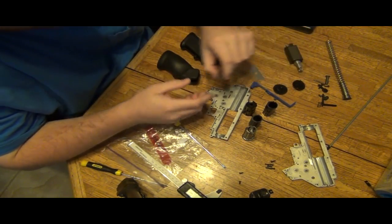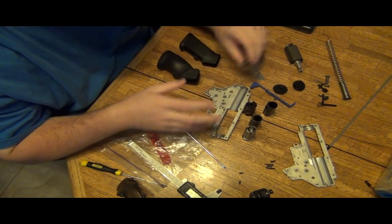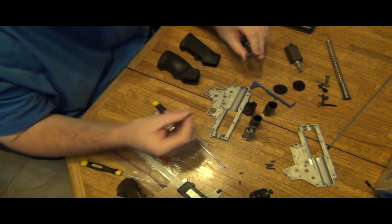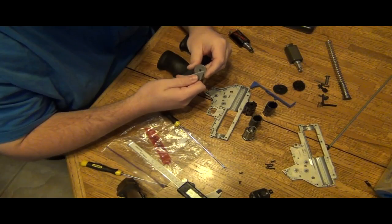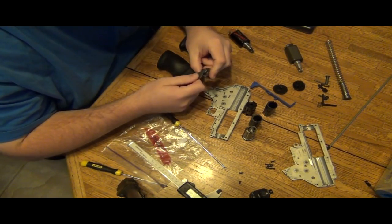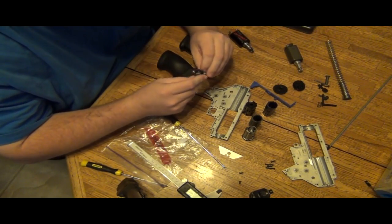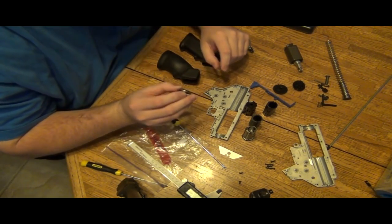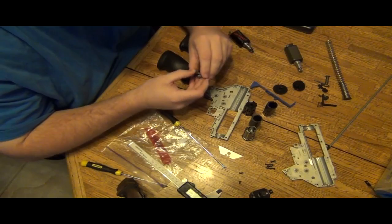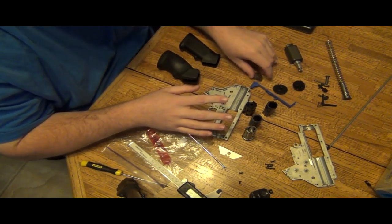Now, let's take your gears, and we put some shims on here, and we're going to talk about how to use the tools. Here's a razor blade. A razor blade's really nice. You can just slide right underneath the axle area and pull off your shims, no problem. I don't actually put any grease on the shims until I'm finally done and I say that's perfect, because I want to make sure that I'm checking the spin and it's what it should be.